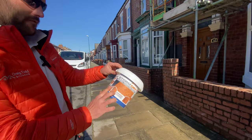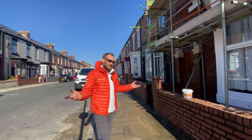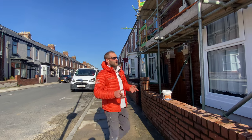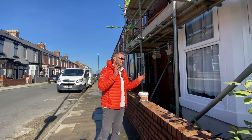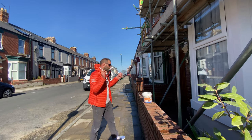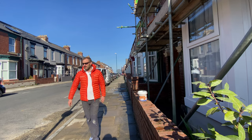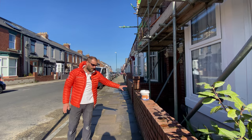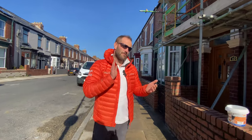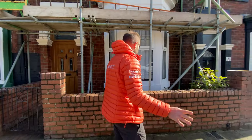If you read this here, it is a breathable product. I've heard people say if you apply that, it doesn't let the wall breathe, which is bad, because what we are doing here, pointing with lime, is so that the wall can still breathe. So with this on, our wall can still breathe, and we are just giving it an extra layer of weatherproofing, waterproofing, which is fantastic. With all of that said,